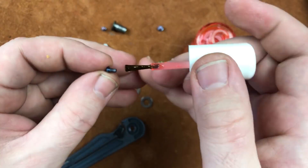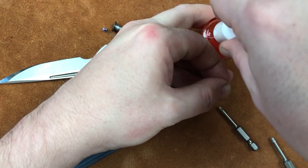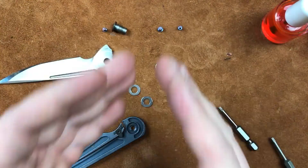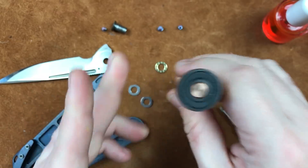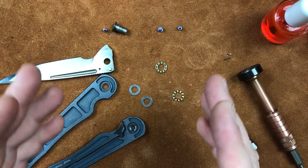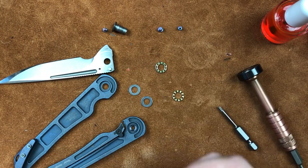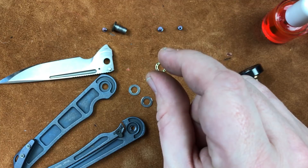Now, what we're doing here is putting together a knife that you flip open, and that puts a lot of shock across the entire knife. That shock is exactly the way Spyderco tells you to break Loctite — you take your driver, put it down in there, and tap the back of the driver with a hammer to shock the Loctite and break it. Vibra-Tite, being gummy, absorbs the shock — it's kind of like a shock absorber for your screw. It's a bit sticky so it holds things in place, and it's a bit gummy so that whenever there's shock from opening it, it flexes and goes right back to where it was.